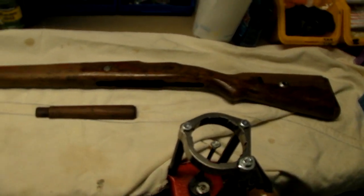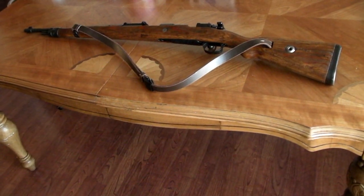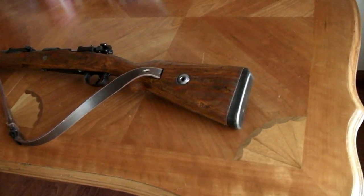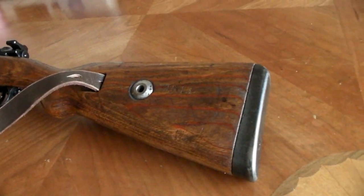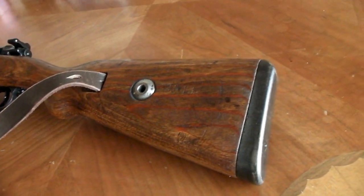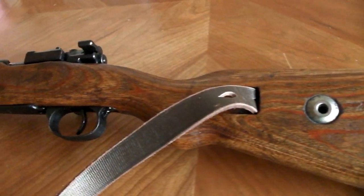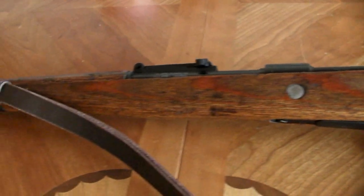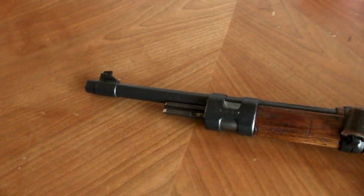You've got to wait 24 hours between coats. Here's the finished product on the K98 — I put on three coats of tung oil. It has a little bit of gloss to it, sort of a semi-gloss finish more or less. I'll post up some pictures after this of what it looked like with the shellac the Russians put on it.